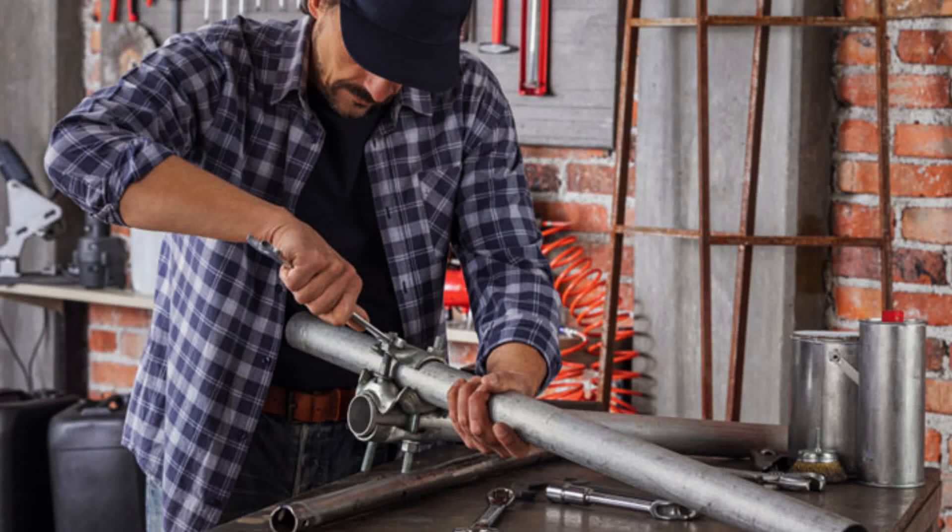Step 2: Prepare your materials. Grab your metal pieces and punch or drill one hole in each piece, large enough to fit your roofing nail. Cut off any extra length from your nail. Step 3: Mash and peen. Look for the small peak in your rivet and mash its sides to sharpen it up. Next, hit it from the top to flatten it out and then from an angle to make it mushroom out. Step 4: Finish. Using the ball end of a hammer, repeat Step 3 and finish off.